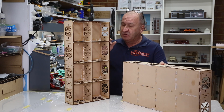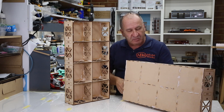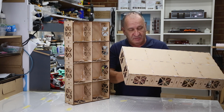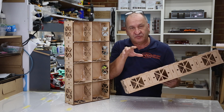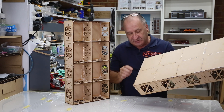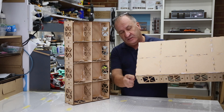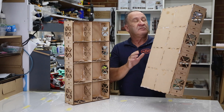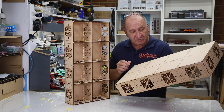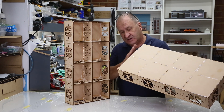About 20 minutes later I now have the top surface all glued and inside all glued. I'll let it settle a bit more and just go over maybe a few spots on top. As the glue dries and shrinks there may be a couple of little holes that appear, so I might add a couple of extra spots. Quick tip on doing the sides: I just ran a bead along the top and then with my finger scrubbed it into both the top and the side. Don't forget the corners. I'll just check it in half an hour and add a little more if needed; if not, it'll be dry enough in the morning. About 24 hours later I'll give it a very light sand to remove any high spots and then paint it.